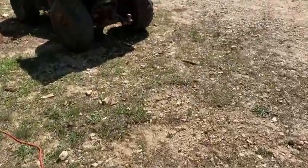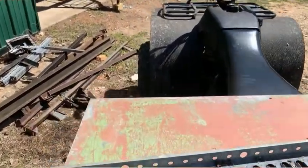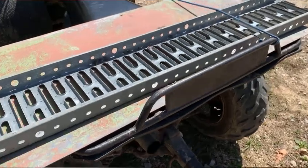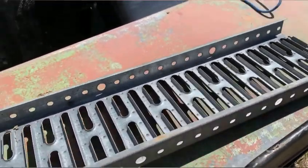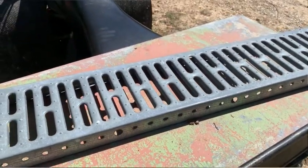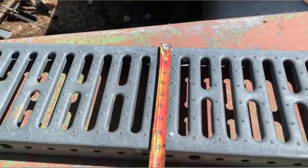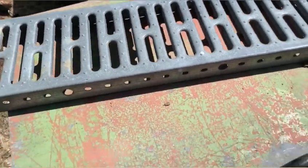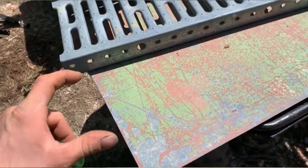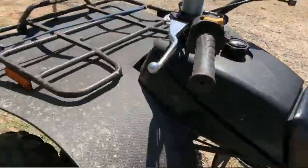I have a neighbor that collects almost everything scrap metal and he'll basically give me almost anything - I'll throw him a little money now and again. I went over there and dug around and found this piece, whatever it was from - probably an industrial staircase. Perfect dimension. I think it's nine inches, and the old step is eight and a half, so basically perfect. I'm going to cut a piece of sheet metal and weld it on the bottom to make the torsion strength really strong so there's not more stress on one bracket than the other. That's what we're going to work on next.